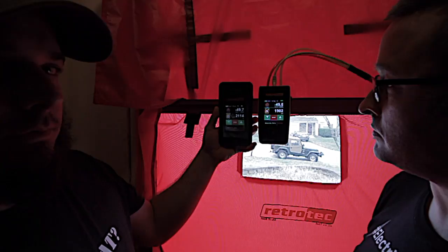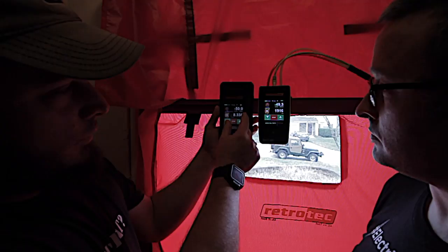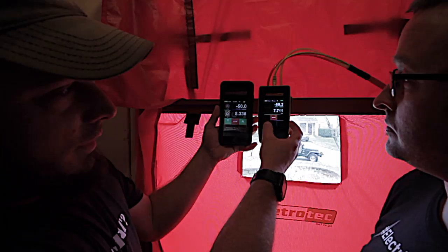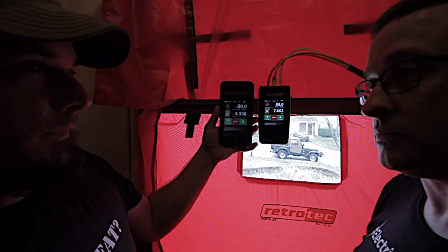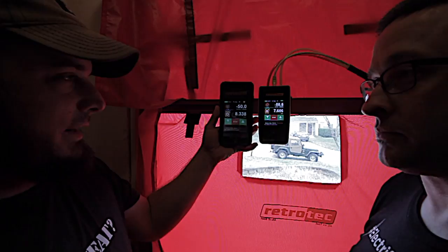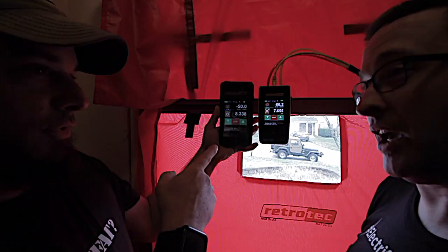Now, the other shot that we got originally was air changes per hour at 50. And so we're going to show that as a comparative as well. So it would appear that by simply closing off the supply registers in preparation for the duct test, we have already reduced leakage almost a full point. Yeah, well, about 10% of the actual leakage.